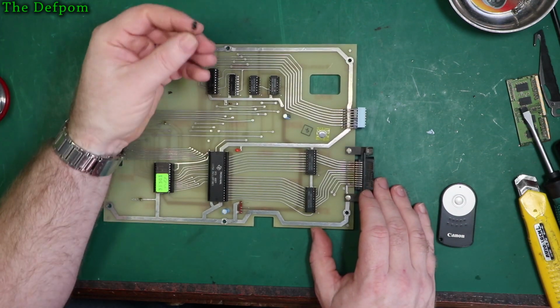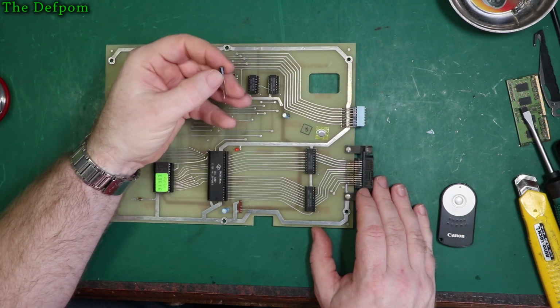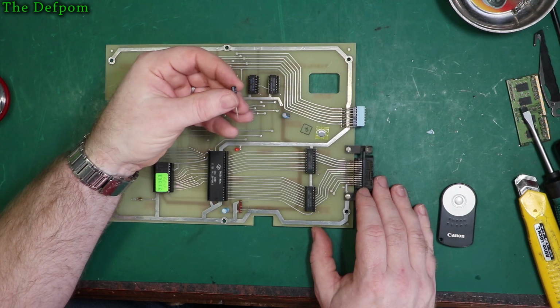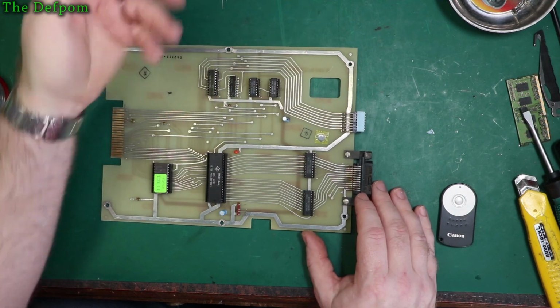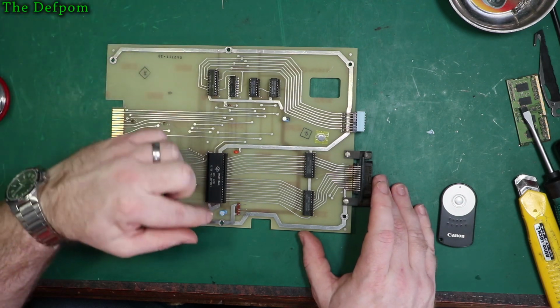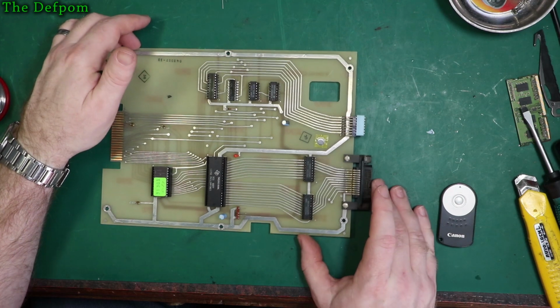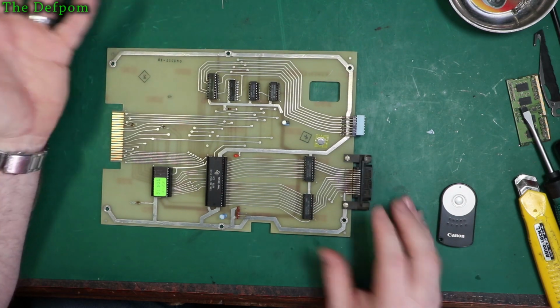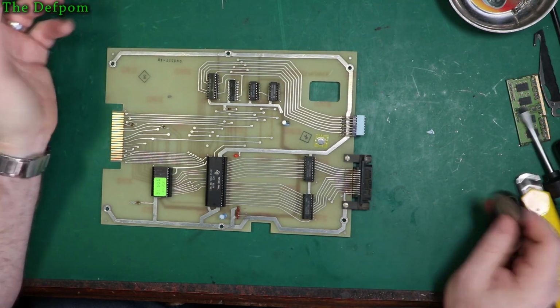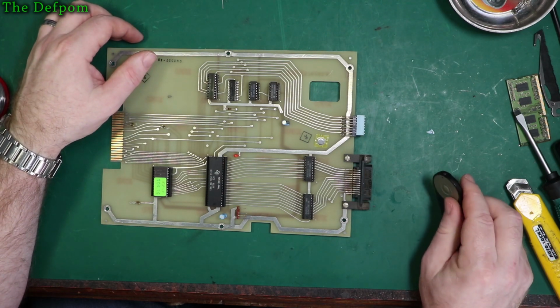Alright, so the capacitors are out. These are ZLG series, in case you care. I really don't. It's just power supply caps, not too critical a function. So the original caps are 85-degree caps. The new ones are 105-degree. I always do an upgrade if I can. I always buy 105-degree caps. You pay a bit more for them, but then you know you've got a longer lifetime generally.